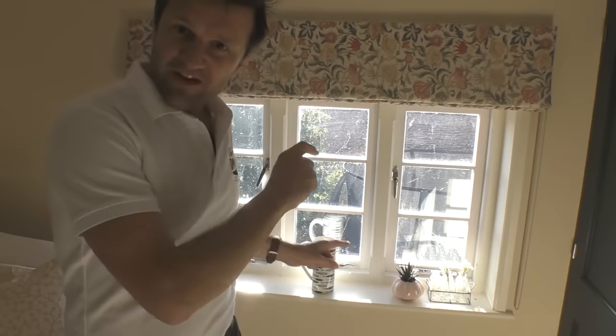I'm gradually installing double glazed windows as part of upgrading the house, but there's very little point just double glazing your windows, because in houses like mine where I've got no cavity wall insulation, the walls in the rest of the room just act like a massive fridge. Any benefit derived from the double glazing is a drop in the ocean compared to all the heat loss in the rest of the room.